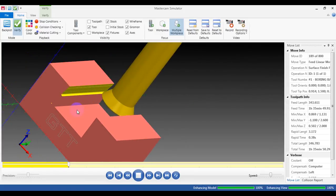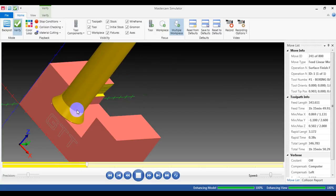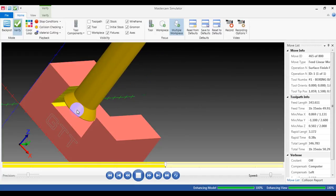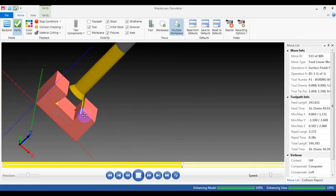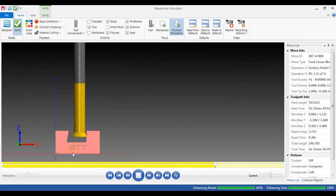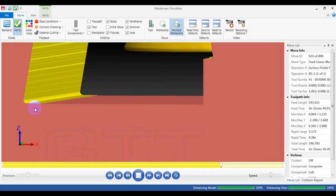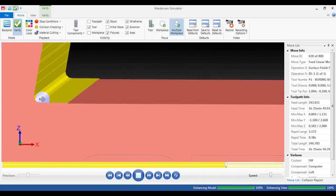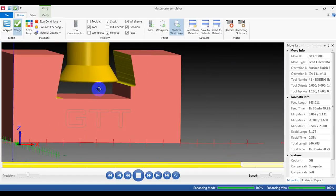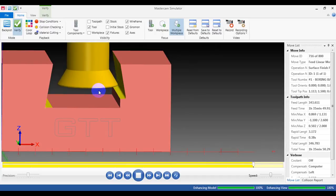The surface finish is poor, but I think you can use a smaller step over, and then you need some sandpaper. So we got the dovetail successfully cut. But you can see that because the tool has a corner radius, we don't get a sharp edge at this floor.